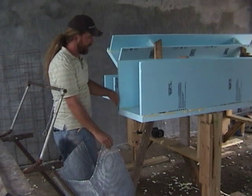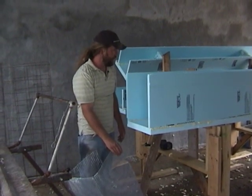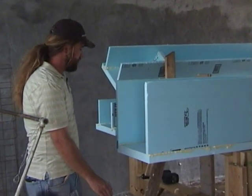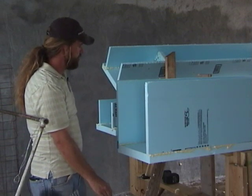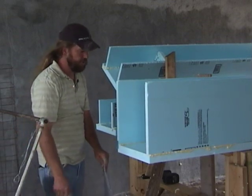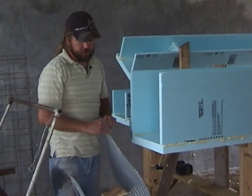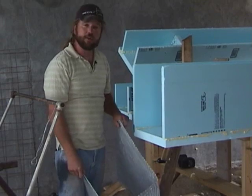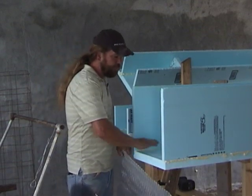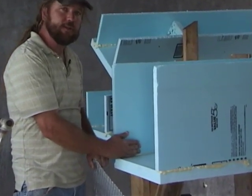Since these are eight feet long and we've got about an inch of cement on here, from experience that's going to take about a half a mix for each one — so that's about 150 pounds. The wheelbarrow weighs about a little over 300. What the laminated ferro-cement technique is about is fully encapsulating this kind of reinforcing to make it do its job, which is to give a lot of tensile reinforcing, allow a lot of flex without cracking, and give it just a lot of strength and toughness. So we start out plastering a thin layer of our composite mix, a PVA fiber reinforced mix.